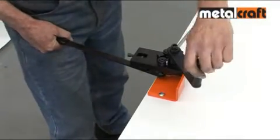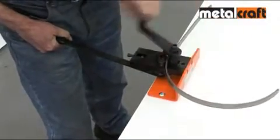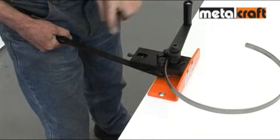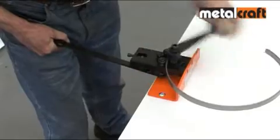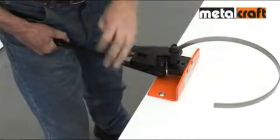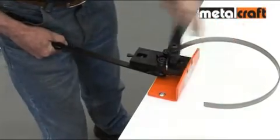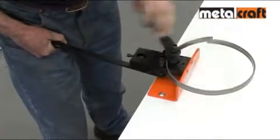At the same time, use the winding handle to drive the steel strip through the rollers until you get to the far end. Then increase the pressure a bit more and drive the steel strip back the other way and watch your curve start to take shape. You then repeat this, increasing the pressure on the long handle each time, until you achieve your desired curve or circle.